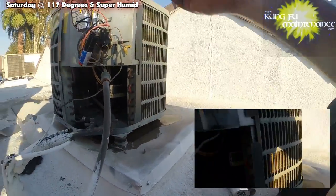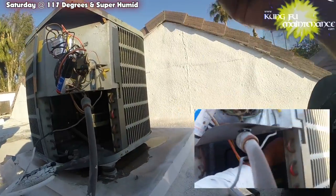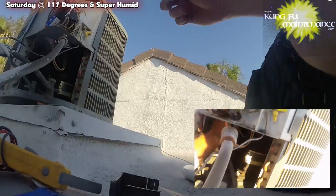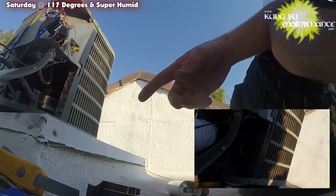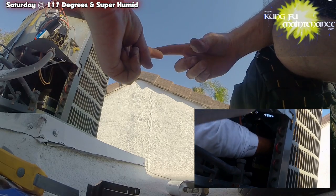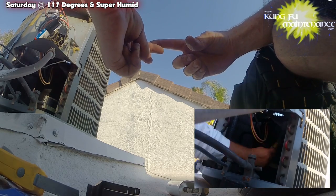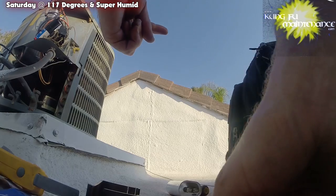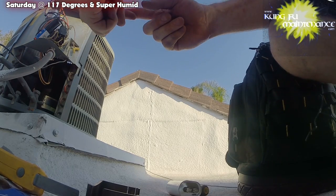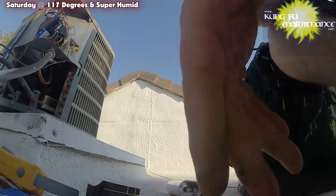What happened was inside we tapped on the top of the compressor. I think what happened is the thermal switch goes out on a high limit — it separates the connection. My thought is it was close, and we gave it a little smack on the top of the compressor — just enough. That bumped it back together and now we're back in the mix.